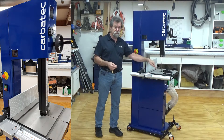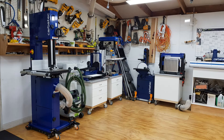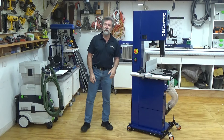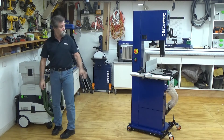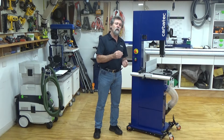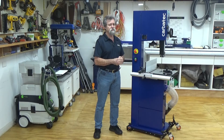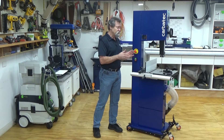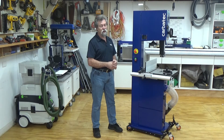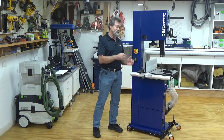Leave the machine in a safe, clean, and tidy state. Do not use faulty equipment. Never leave the machine running unattended. Do not force a wide blade on a cut of small radius — use relief cuts when cutting sharp curves. This is a great machine if you use it in the correct manner. Using the tips covered here for operation and safety, this machine will give you many years of fantastic service.